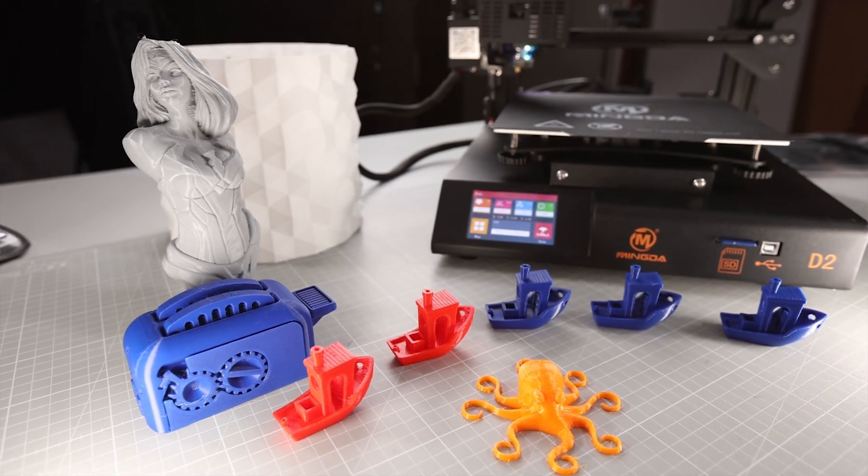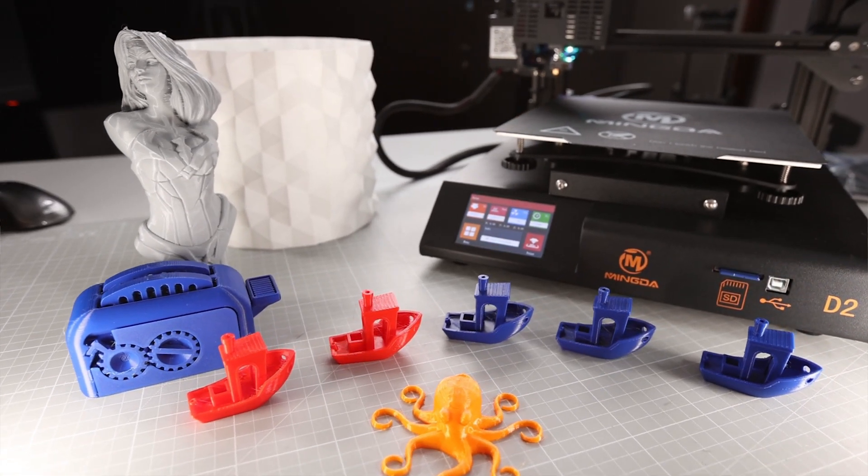From a quality perspective this printer gives really nice results, but the profile needs tuning. I'll link my optimized Cura profile on my website in the description. For print speeds, I used 50–60mm/s for PLA and 20mm/s for TPU. On a direct drive — which is heavier than a Bowden system — I wouldn't go higher than 50–60mm/s unless you're willing to compromise on quality.